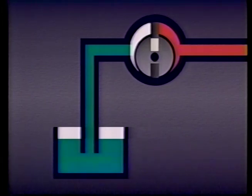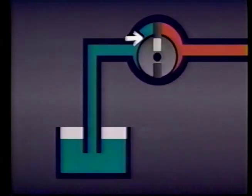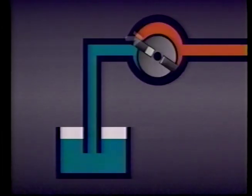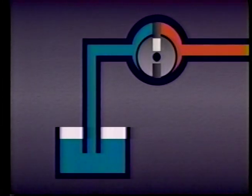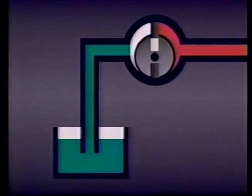The pressure applied to the liquid by the atmosphere is used in two ways. First, it moves the liquid from the reservoir up the suction line to the pump inlet port. And secondly, it's used to force the liquid into the pump to fill the moving rotating group. If moving the liquid from the reservoir to the suction port requires too much of the atmospheric pressure — for example, when the pump has been mounted too high above the liquid level in the reservoir — there is not enough pressure left to force the liquid into the rotating group fast enough.